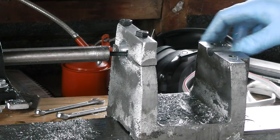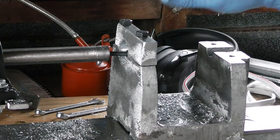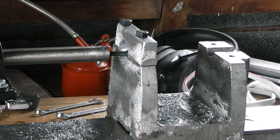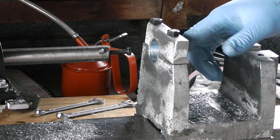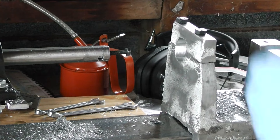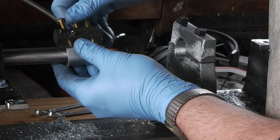You may have noticed there were just as many chips coming out of that bore when it was coming back out as when it was going in — that's because the bar deflects. I'm measuring between the top and bottom, not the sides, because that's where the shims are. I'm going to have to be very careful in how I adjust the cutter on this one, because it's getting very, very close to the final dimension.